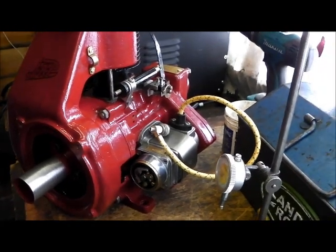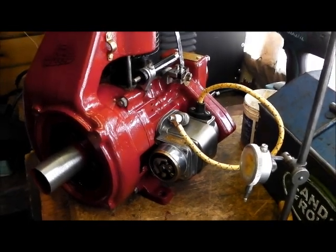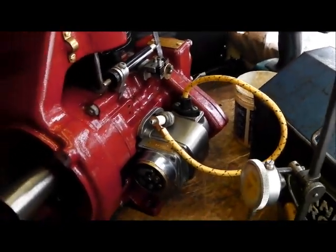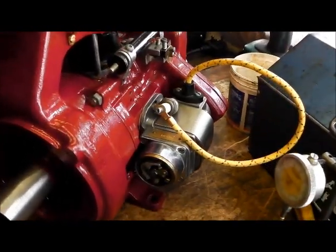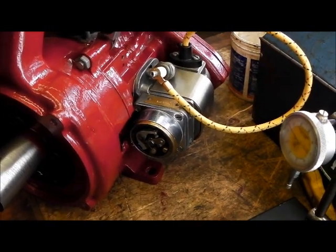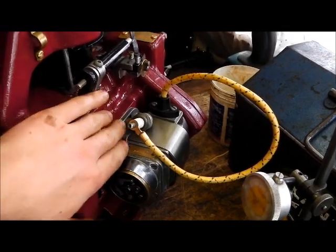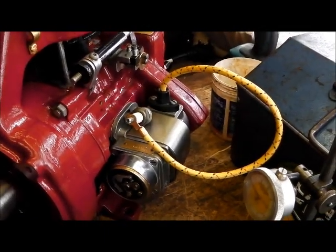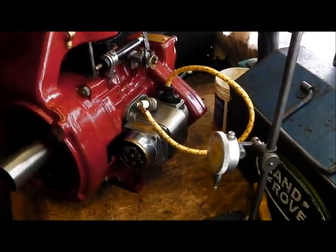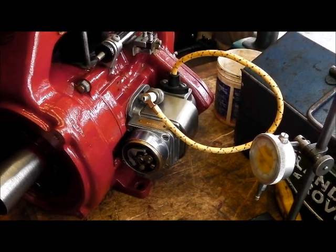One problem I did have is when I fitted the magneto. I initially thought this might be a continuity problem with having put a plastic shim underneath, but there was no spark when I turned the engine over. I remember the mag sparked at low speed before, so I saw no reason why it shouldn't work. I checked for continuity between the block and the magneto - fine. So I thought I'd get it all together and wind it over with the handle to see if a bit of speed helped. Still no spark.